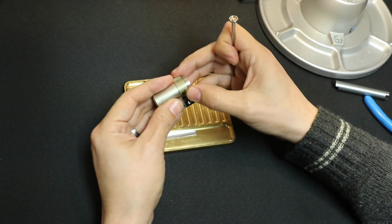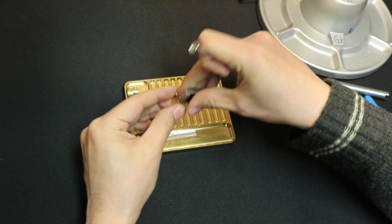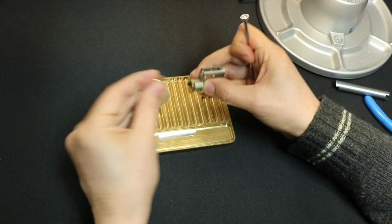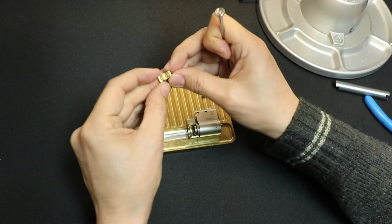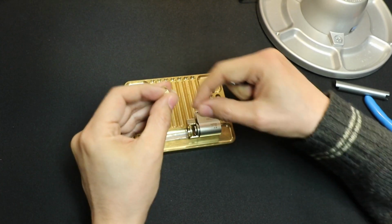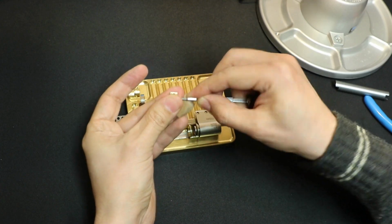The third one, you just rotate the cam 180, and there's that third one. And again, if you hold it gravity down, you can rotate the cam back and forth, and that piece falls out. So that piece has the groove on it, and that's what stops this thing turning, and it turns together with the key. So the key will allow this piece to turn like that.